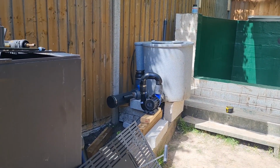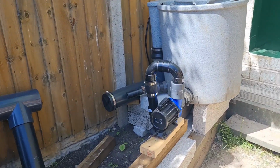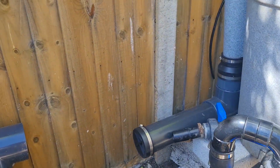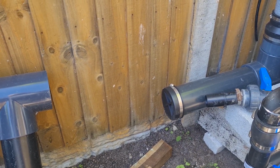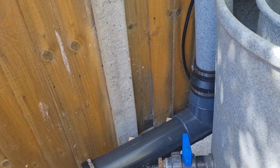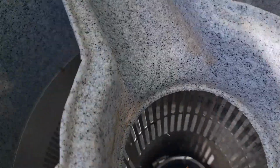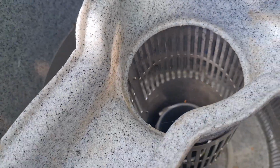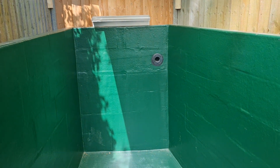I mean, to be fair, I've coupled all the piping together. There's a cap that's gone on the end of that to finish that off temporarily. So that will be the waste, will go through there, not through that one currently. So it'll still come in through the bottom drain. It will still come in through here. It will still exit through there. It will still go through the pump, and it will still go back through the returns.